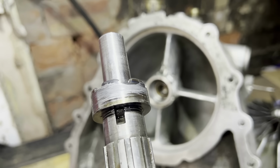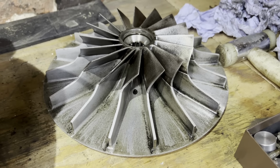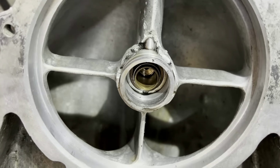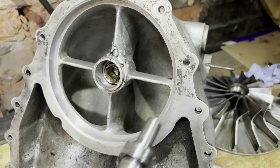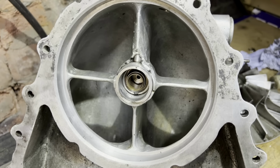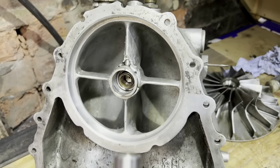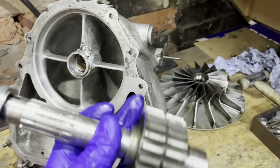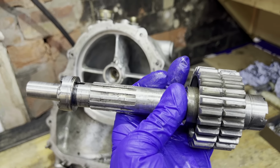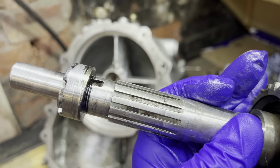It's blue in places. So I just caught that in time because the next thing that would have happened would have been that these blades here would have been machining their way through the casing. So it's all happy days really. Dan said he'll weld all this up for me properly. Then I'll stick it on the miller, clock it all up accurately off this register around here, and remachine it. I might just remachine the bronze bush that's already in there, and then make the two replacements to go in between that and the shaft itself here. And the shaft actually looks okay anyway, so there doesn't appear to be any damage to that. What I am going to do is clock this shaft up and just check that it is actually straight, because if it's dead straight then it means that that nut must have been running out, and quite possible. I'll fit another nut on it anyway.